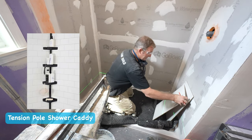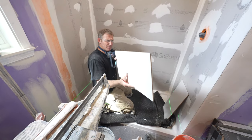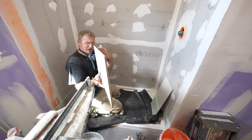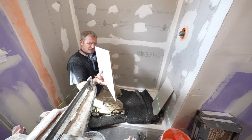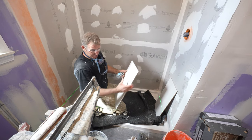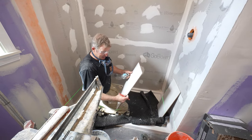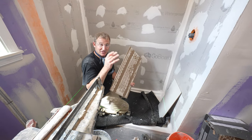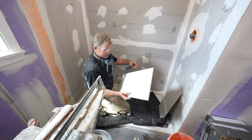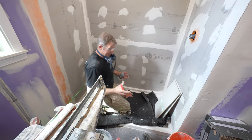So we're going to be sticking with the 1/3 pattern as we did on the floor. But one thing you always want to pay attention to is the curvature of your tile. If this is bowed considerably, then you want to stay on that third pattern. But if it is fairly flat, then go in half pattern, like a standard brick pattern, which makes a lot of sense. But in this particular situation, the customer wanted a random pattern, so we're going to be doing those third patterns.